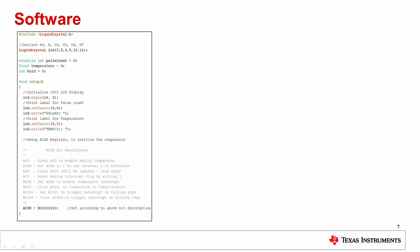Now we will step through the sketch that was loaded onto the Arduino during the previous demonstration. A link to this code will be included in the video description. Prior to the setup block, we include the LiquidCrystal.h library and declare the necessary global variables for our program. The variable pulse count, which holds our continuously updating count of pulses from the LMT01, must be declared as volatile. Using the keyword volatile lets the compiler know that this variable can update at any time, even when not used in the surrounding code — this is necessary because the pulse count variable will be incremented out of order by the ISR. Inside the setup block, we initialize our LCD and print the temp and pulse labels.